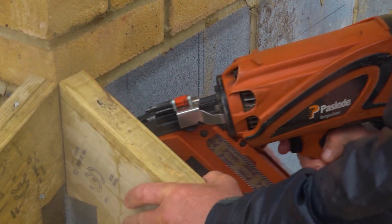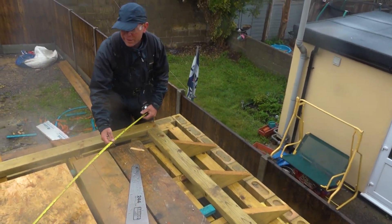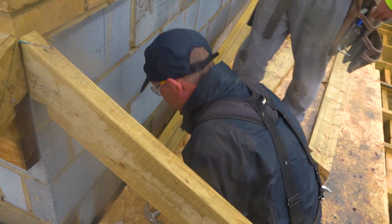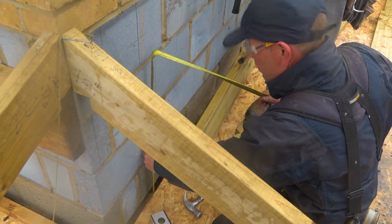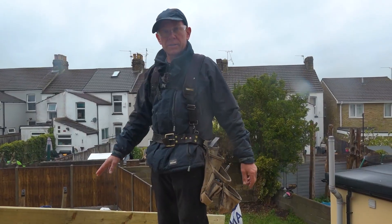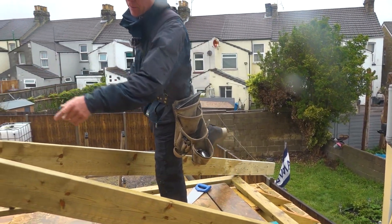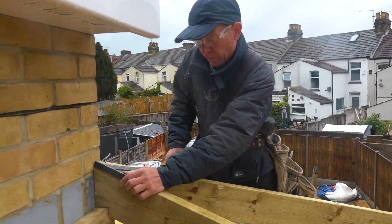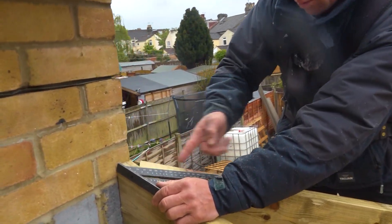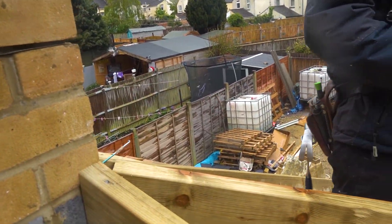We're on line, because that's not 45 this time, so that's about 24-55. We've got our 18-degree plumb cut on it, it's not looking too bad. You can see it's nowhere near 45 running out there, where it would normally run — it would run right out here — because of the difference in the pitches.